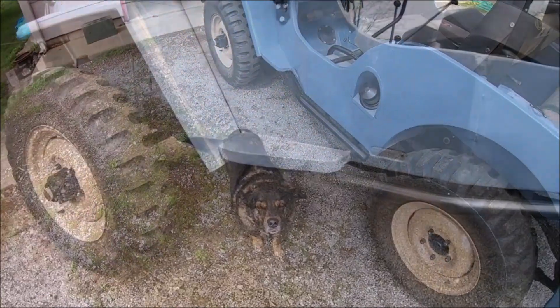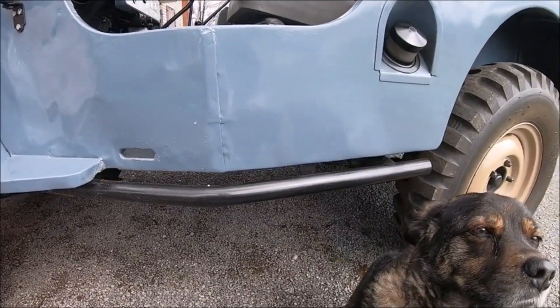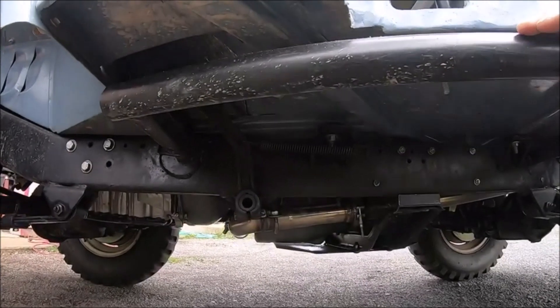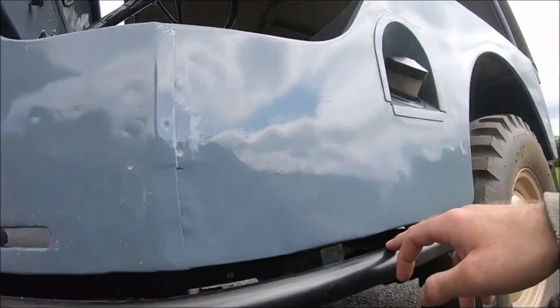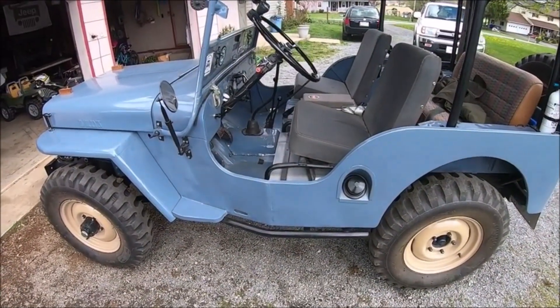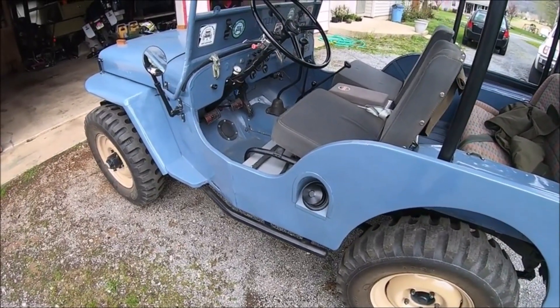She approves! When I built it I wanted to make some body protection as well. This is the same tubing — I had leftovers — and that's welded to the frame and then bolted to the tub so it can still be removed. You can remove the body; it's just to kind of help if you're sliding over rocks or logs to keep from folding over the bottom edge of the tub.